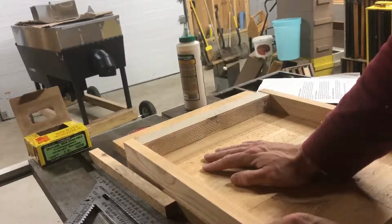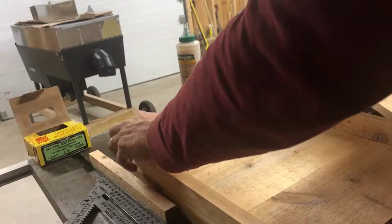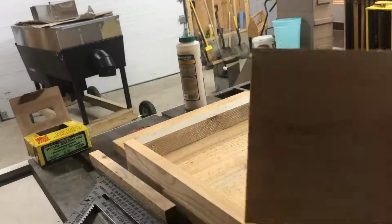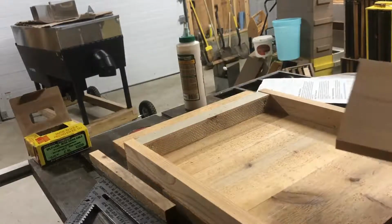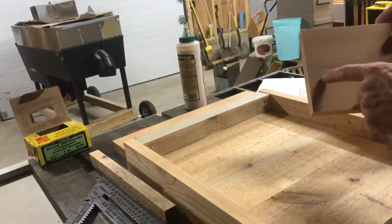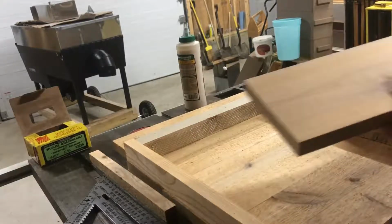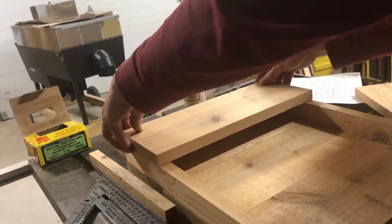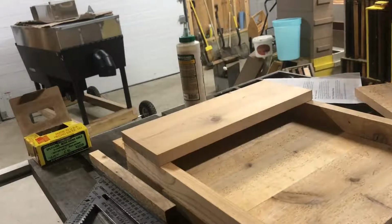The inside is the rough. And so all we do is make sure these are parallel or flat with the top of the roof. Then we take our first piece, and what I did, it's not showing up great. I don't have a light over my saw. Anyway, I struck a line down the middle of the side brace, and then I measured, these are 5.5. So I measured 1 inch down from either edge, and then right in the middle. That way I can put my nails in a place that is going to be halfway down the board and also symmetrical.